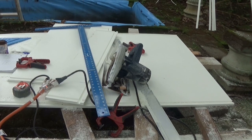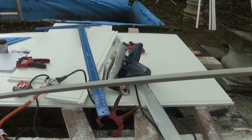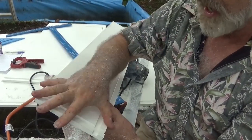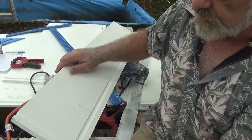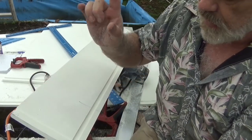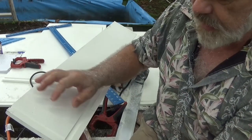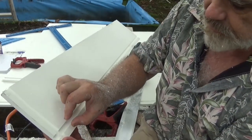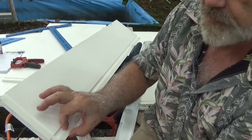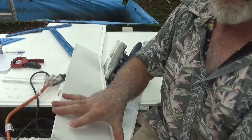After squaring up, you're left with a long thin wedge-shaped piece - definitely save those, they come in handy. Now, how wide should the ends and sides be? For the sides, add however much thickness the sheet is - 12 millimeters - plus however much buffer you decide to leave, which in my case is another 12 millimeters. So if you want a six-inch block, you make the side seven inches; for an eight-inch block, make it nine inches.